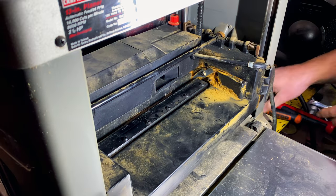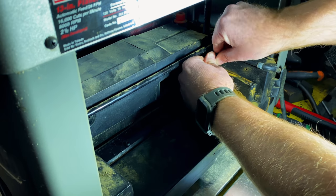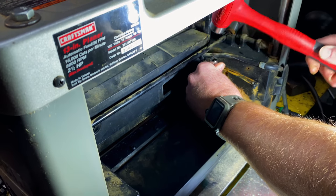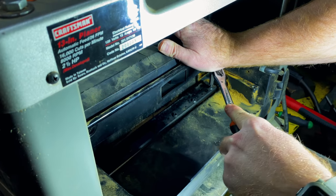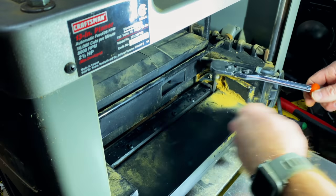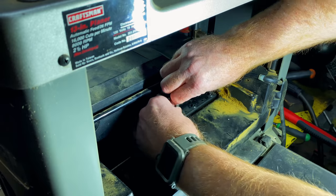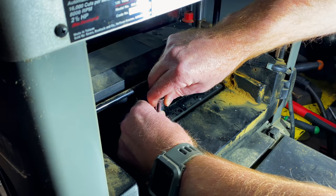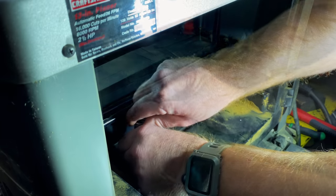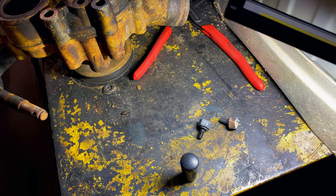That's not advised by the way. Let me try that other one, see if I can get a better bite — even with that cord in the way. I can't even get on it straight. So I'm going to end up welding two on this side as well — this one and that one. But we got the rest of them out. It is what it is; you're not going to win every time with stripped screws. We'll weld two nuts on these two and get them out. Here's what they look like on the welded nuts I took out a while ago. We'll have another pair just like that and then we'll have to pick up some new screws.